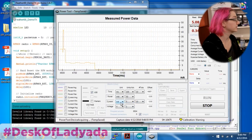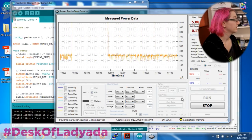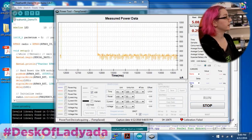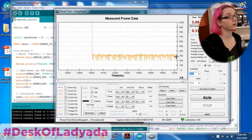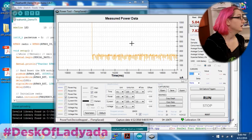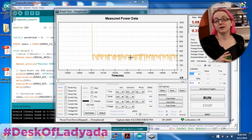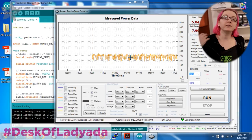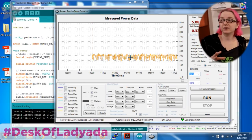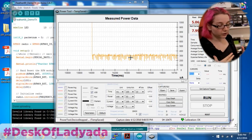With the device I can really zoom in. The spikes of power are way off the scale, but for the most part we're drawing about 300 microamperes — about 0.3 milliamps. This is pretty good; this is pretty much as good as it's going to get for the 32U4 on the Feather 32U4. The reason is that if you just had the bare chip with no accessories, you could probably get it under 100 microamperes. But I did some experiments and pulled off components.